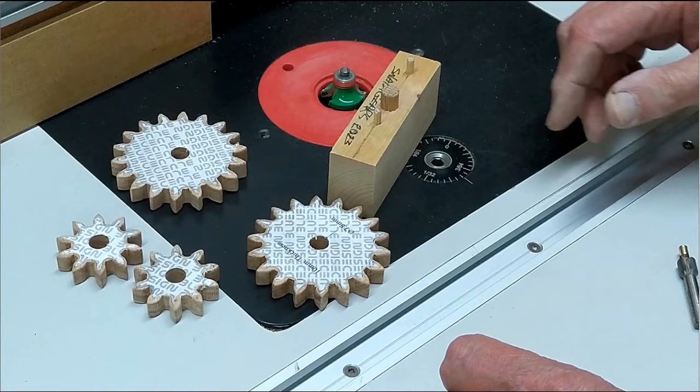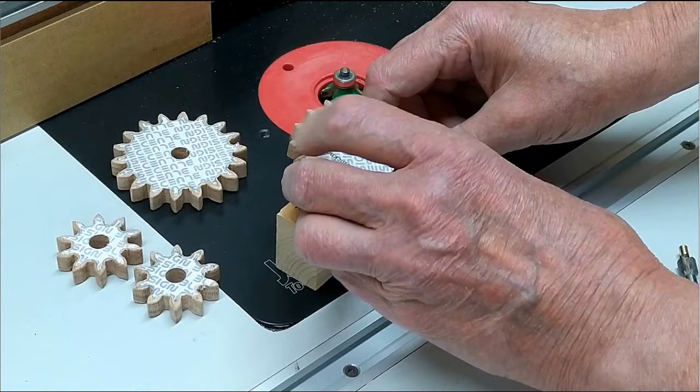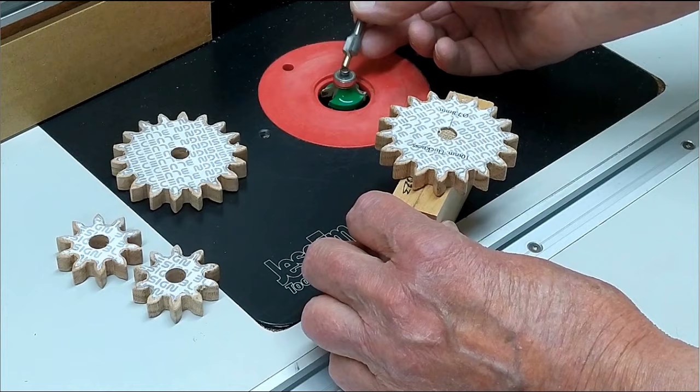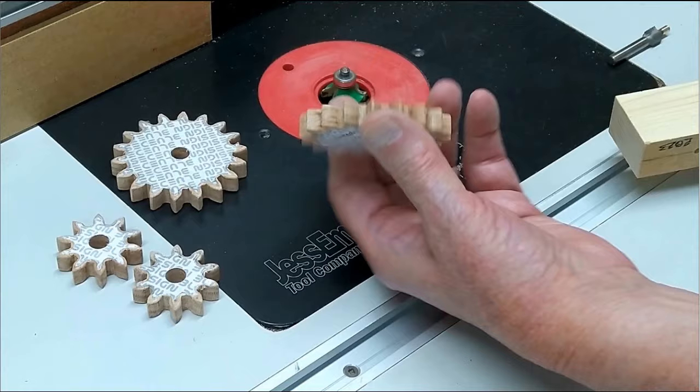The snail has two different gears, and the plans do not show the edge rounded over, but I think they look better that way. I made a jig and it has a removable pin. A large gear goes on there and engages with one tooth, and I'm using a much smaller round-over bit. You can work around that, take it off, turn it, and do that about three times and you'll go all the way around, then flip it over and do the other side.